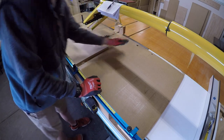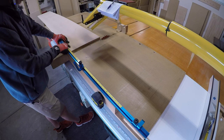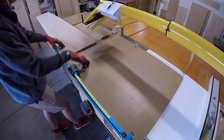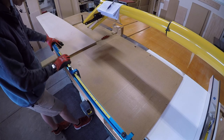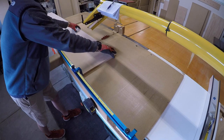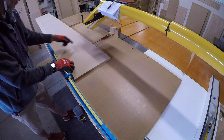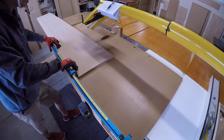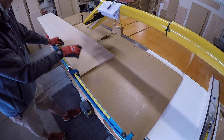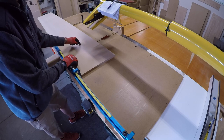If you're bottoming out before the blade is completely buried, you can make those slots longer. Whatever the case, when you push through you don't want to see any of the blade — you want it completely covered. And if you use a stop, once the piece is in there you never, ever want to pull it back with the piece wedged between the blade and the stop. If the saw blade is spinning and you're in contact with the wood it's going to damage the piece, or you're going to get kicked back.